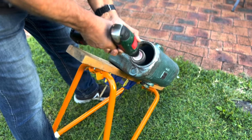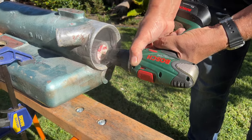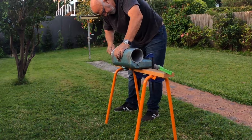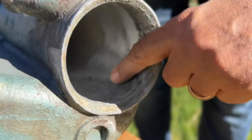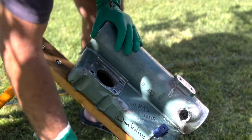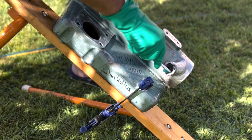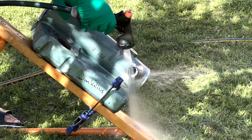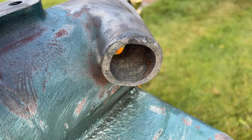We reduced those pitted surfaces with a sanding wheel, then we used a rotary wire brush, then a hand wire brush, and then a fine hand wire brush, all of them being stainless steel. After the mechanical abrasion, the pitted surfaces were scrubbed with a diluted barnacle buster solution, and finally with a very strong 1-to-1 mix of the barnacle buster concentrate with water. And that was applied with a toothbrush. It was a strong but very short exposure, and it really etched the pits beautifully, exposing the bare aluminium casting.